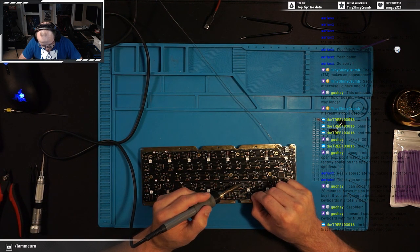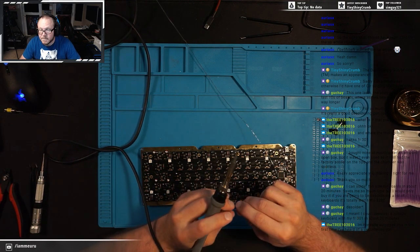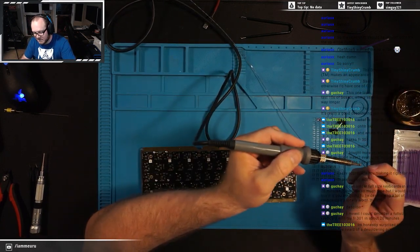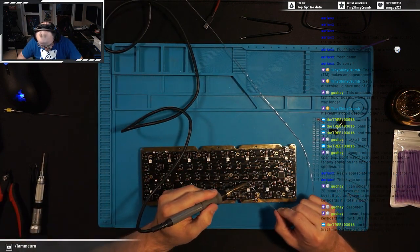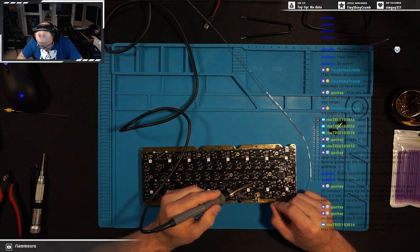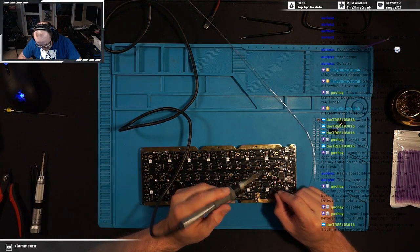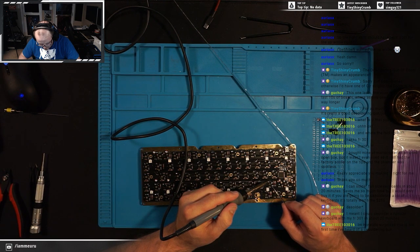Right? I'm surprised it's the first time you've heard of a desoldering gun. Yeah, they're the way to do it, man. Don't desolder with wick or a hand pump. Not like a whole board, anyway. If you don't have to. I mean, if it's all you've got, it's all you got, right? But...